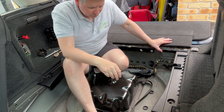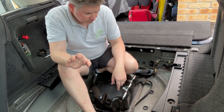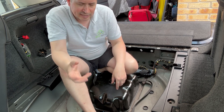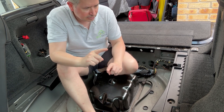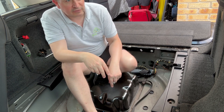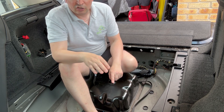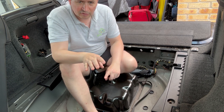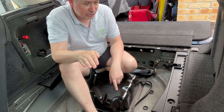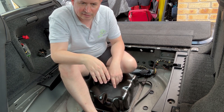What I did yesterday was go into the settings and change, using the IID tool, create a new profile which lowers the car down. So mechanically, I raised the car using the arms - the Proud Rhino level sensor arms. That raised it two and a half inches, 65mm or 63mm, because I couldn't work out a way to raise the car using the software that much. So what I have now is a car that thinks it's normal but is actually 63mm higher than it thinks it is.